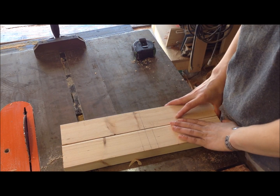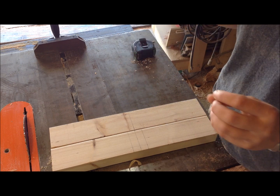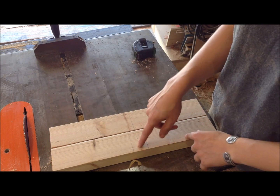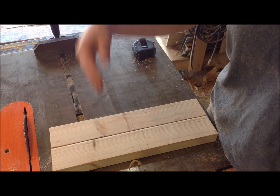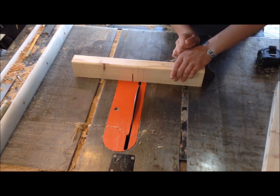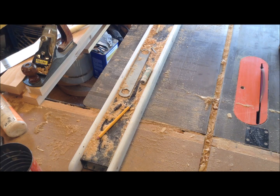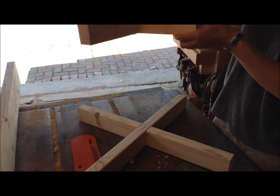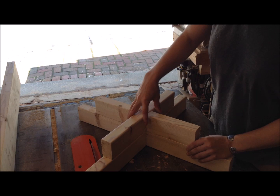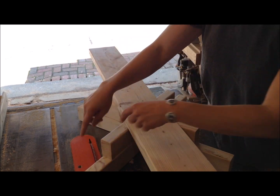I have my base lapped together. There's going to be a second base elevated up in the air where the launching mechanism will rest. I don't know the exact dimensions yet, so since my blade is set to the right height I'll cut these oversized, mark center, and cut two laps in them — trimming them down later if needed during assembly. I'll then rip the remaining two-by-six into one-inch strips to use as the arms connecting the two bases.